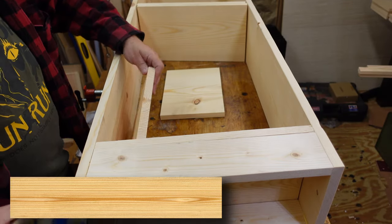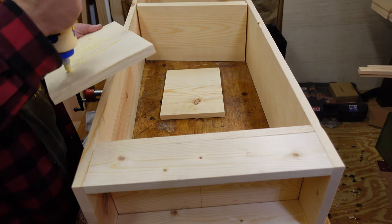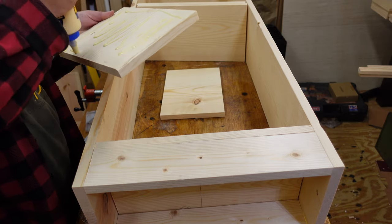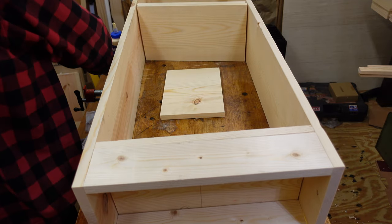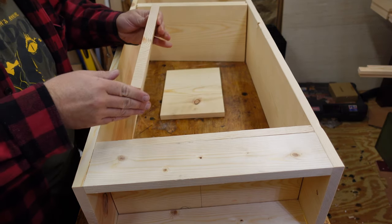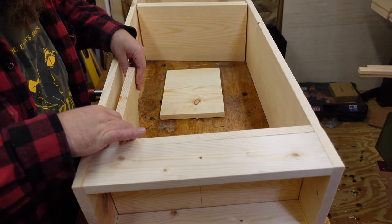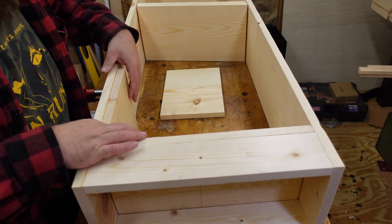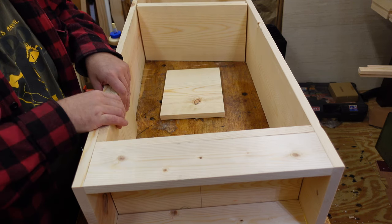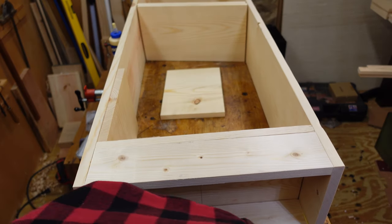Once you have all your spacers cut, it's time for assembly. Begin by putting a shelf across the bottom and the top — only tack the bottom one in for now, as those will help hold the side square. On this specific unit, I've opted for a toe kick — more on that later. Next, take one of your spacers, and I recommend gluing it into place in addition to nails. This glue will add a lot of structural strength. Make sure to bring this vertical spacer flush with the front, as there is a three-quarter inch gap in the back for the back panel.